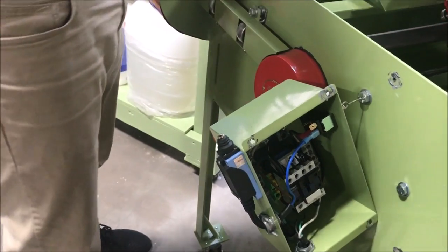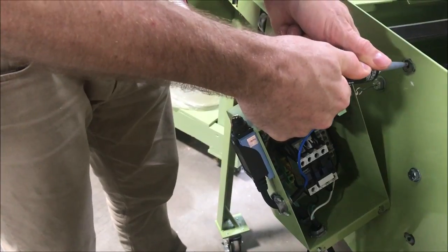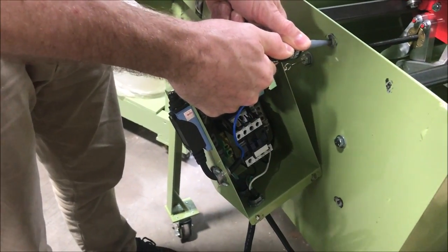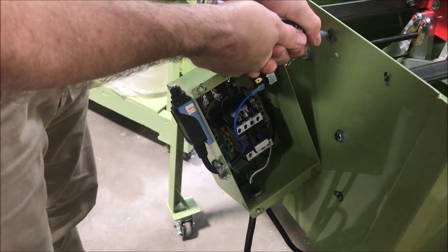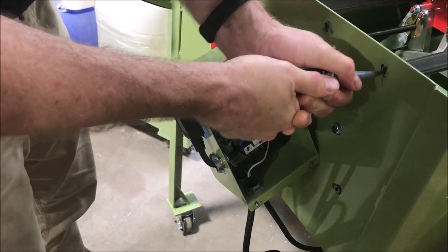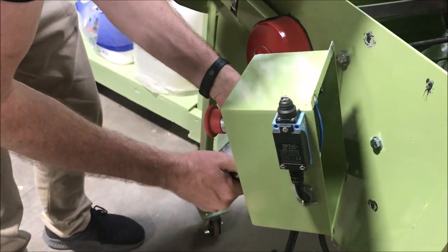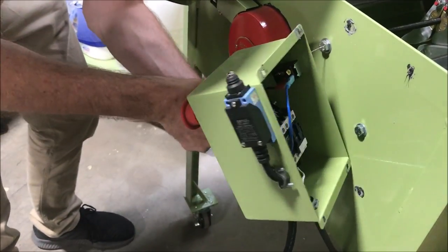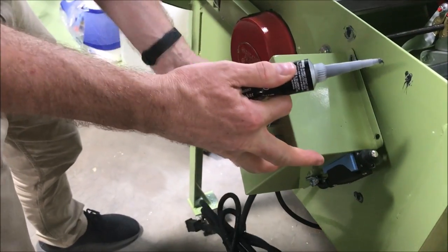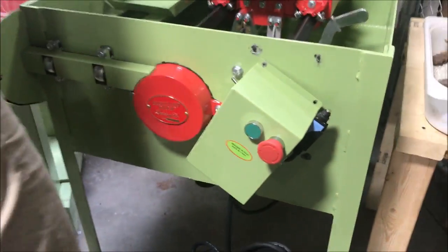When you go to put your box back together, use some Permatex Ultra Black sealant on all four holes and then put the screws in. There's an adjustment to the switch box to adjust its height so the hood switch is working properly on our professional-level saws. When putting it in place, try not to bend that little switch wire. If you do bend the switch wire, you can bend it back with pliers — it's pretty easy to straighten out.